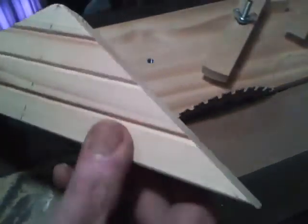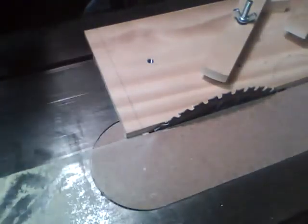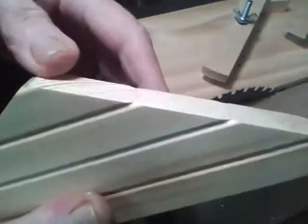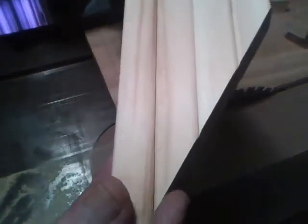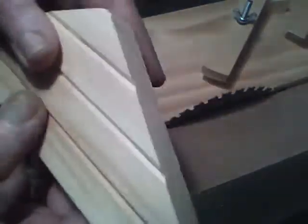Okay, now we got our 30-degree angles. I'll check the bottom dimension. It's going to be slightly large. It's a little over 10.5. The angle isn't really that critical. What we want is for it to be symmetrical. Now I'll go ahead and cut the other one, and then if there's any slight differences, we can always either trim off one side or the other,